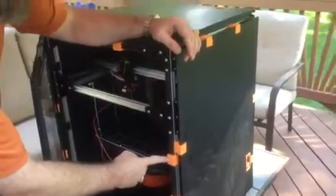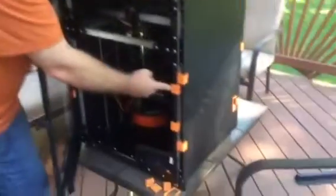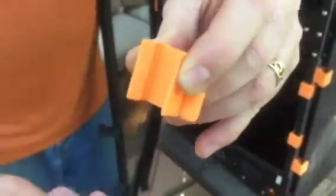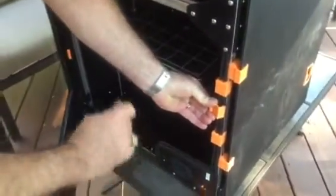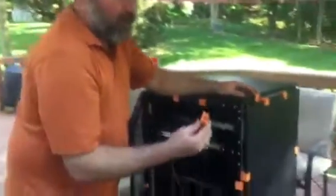These brackets that snap right onto the 2020 are very, very difficult to get on the frame. Unless you're really strong in the hands, you're not going to be able to put this on with your hands alone. The best way I've found is to pry the ends apart as much as you can with pliers before putting it on. I've put probably 40 or 50 of these on and off the machine — I've only ever broken one, and it broke while using the pliers on it. So pry them apart with a little pressure, and when you get it seated on one side, tap the other side with a mallet and it just snaps right on. They're pretty beefy — these are PLA — and I've whacked them with a mallet, pressed them, pried them with pliers, and they still haven't broken.